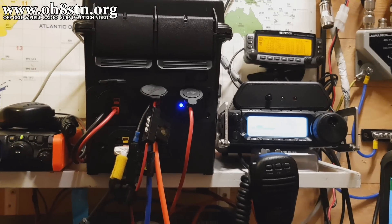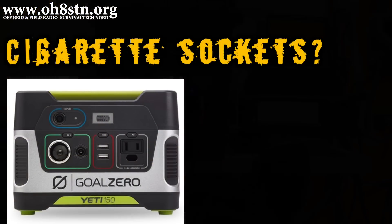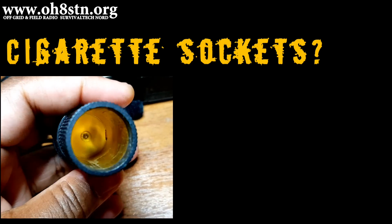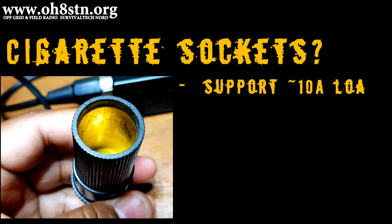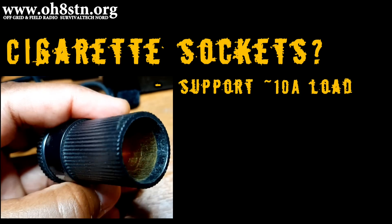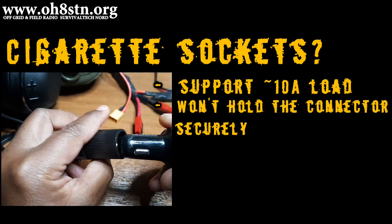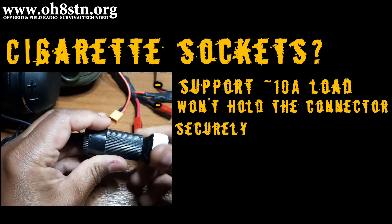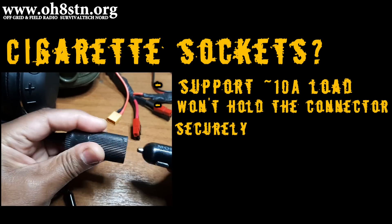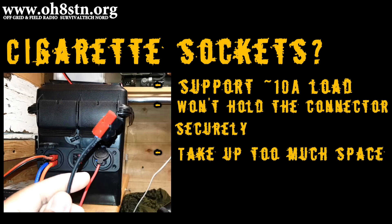Definitely as a last resort, we can use an inverter and add an inverter to the system. And this system will comfortably run a 750 watt inverter without any problem. Another popular question was why I didn't use any cigarette sockets for DC outputs on the solar generator. Well, I was really surprised to receive that question, but I'll go ahead and answer it anyway. First of all, the cigarette sockets are usually rated at about 10 amps. If we want to run high power radio equipment, output power can be about 20 amps, so this rules out the cigarette socket. Another issue is it doesn't hold the connectors in securely — it's basically just a tube with no way of securely holding the connector. And finally, the cigarette socket simply takes up entirely too much room for what it is.